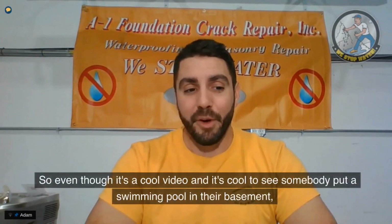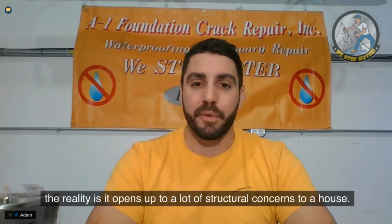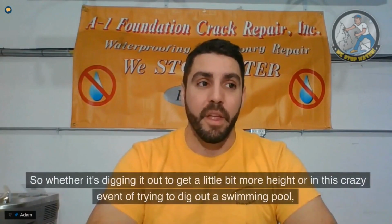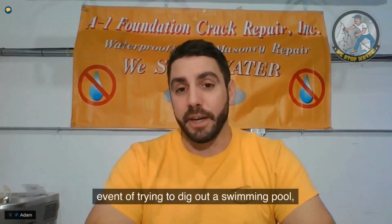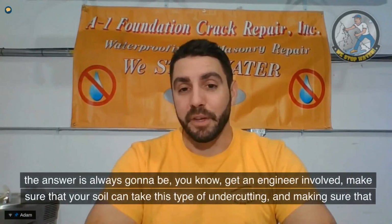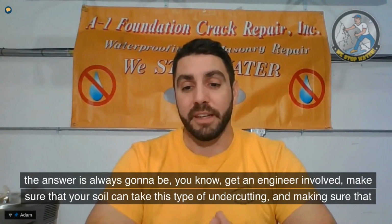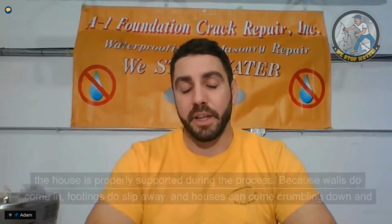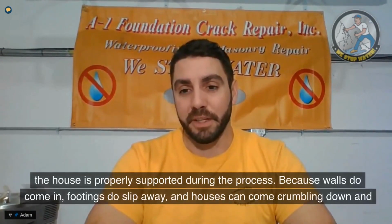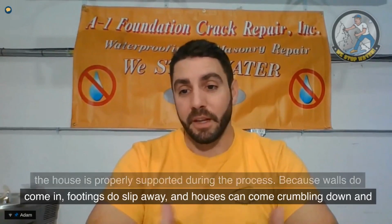So even though it's a cool video and it's cool to see somebody put a swimming pool in their basement, the reality is it opens up a lot of structural concerns to a house. So whether it's digging it out to get a little bit more height, or in this crazy event of trying to dig out a swimming pool, the answer is always going to be, get an engineer involved. Make sure that your soil can take this type of undercutting, and make sure that the house is properly supported during the process, because walls do come in, footings do slip away, and houses can come crumbling down.